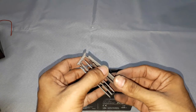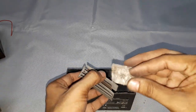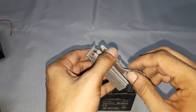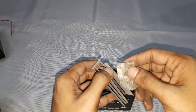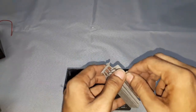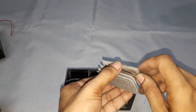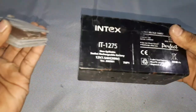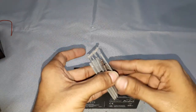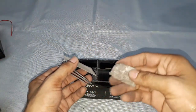The positive and negative battery plates are placed very close to each other but are electrically insulated using a separator. This separator material is permeable — it allows the flow of ions. In VRLA type batteries, the acid is completely absorbed into this separator material. For flooded type batteries, polyethylene separators are used and the plates are directly dipped in liquid acid.